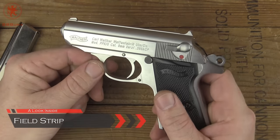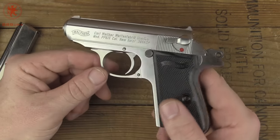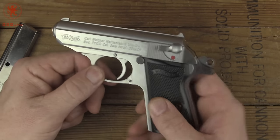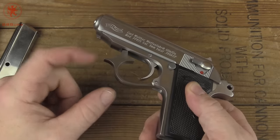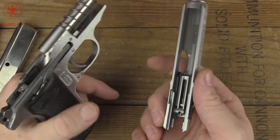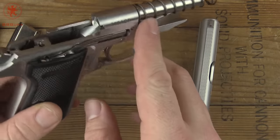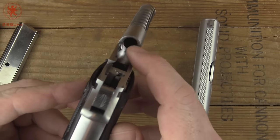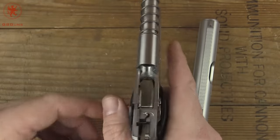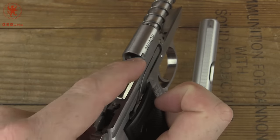Field stripping these is a little bit different than what we're used to in the modern age. Somewhat similar to a Makarov or a Grand Power — the slide is going to be coming off the back of the frame. Pull this piece down and rest it to the side — the trigger guard. Bring the slide back up and let it go forward and off. The spring is not fixed — that is replaceable, which is good. The barrel is fixed. You can see that beautiful feed ramp there, nicely polished. The round can even be a little nose down and it's still going to hit the ramp and head right in.